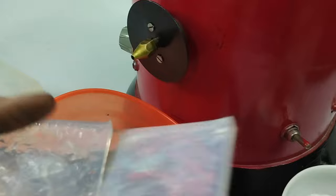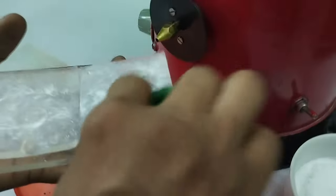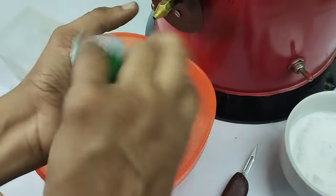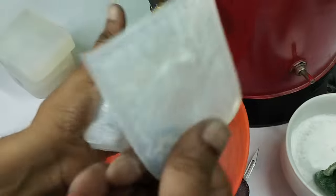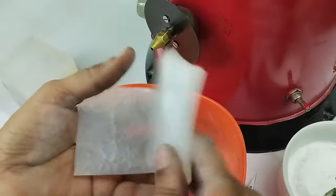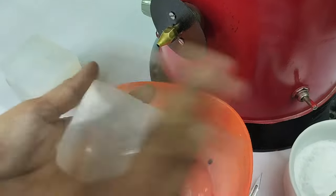So first of all we need to apply talcum powder on it, so it should not stick to each other, and there will not be any moisture inside it. Open it properly, so every cavity should have it. Later you need to remove all this talcum powder out of the mold. Now we will lock it properly,